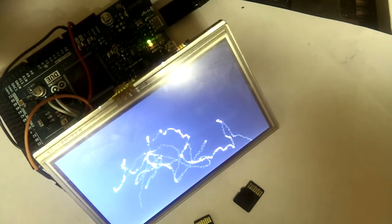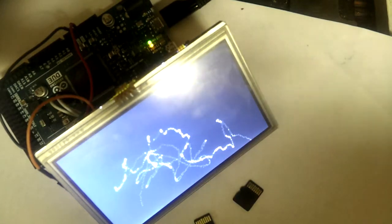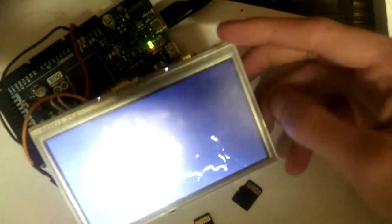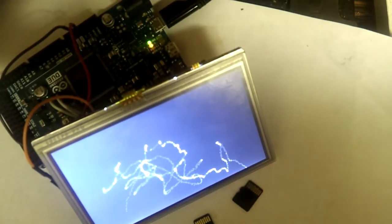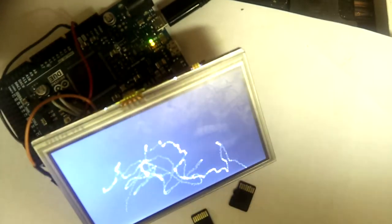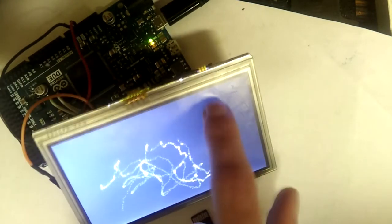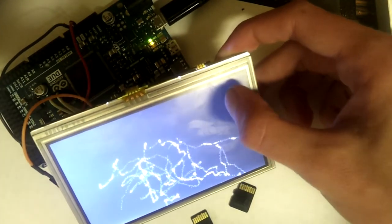So yeah, this thing can do those. It's got particle effects, sprites, anti-aliasing, all these really cool features that you have on a real GPU as well, and that are simply not possible on just the microcontroller. Or it is, but it would be ridiculously slow. And it also can process things while the CPU is doing something else. So for example, this is actually being run entirely by the coprocessor. The CPU is actually asleep right now, it's not doing anything. The coprocessor is completely in charge of this little drawing program.